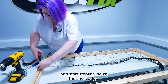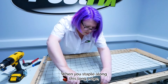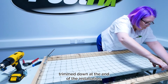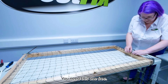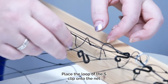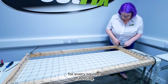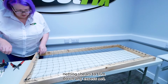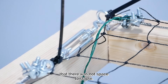Return back to your first corner and start stapling down the short edge, then follow the other long edge. Ensure your net is taut when you staple along this long edge — your netting squares should be square and not diagonal. You may have excess net but this can be trimmed down at the end of the installation. Do not staple the fourth edge; you need this one free. Instead of staples, which are permanent, the last edge will be fixed with the netting S-clips. Place the loop of the S-clip into the net and the hook of the S-clip onto the wire, doing this for every square of netting. Once you are happy that the net is fixed taut without folds or bunches, use your sprung netting shears to trim down any excess net. Place netting corner ties on any squares where there was not space to staple, for example at the barrel strainer.